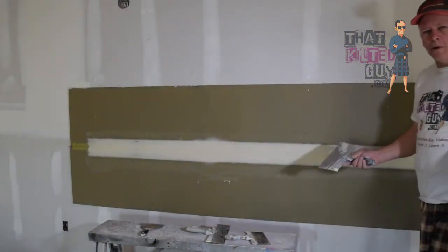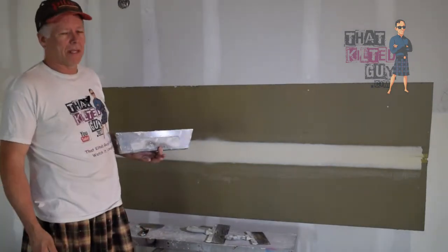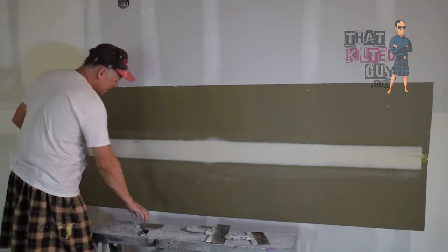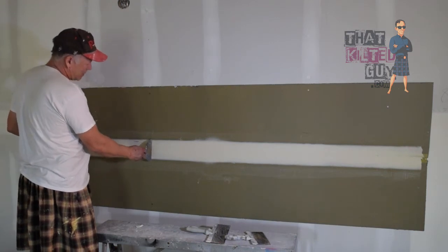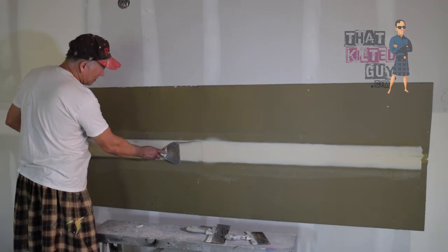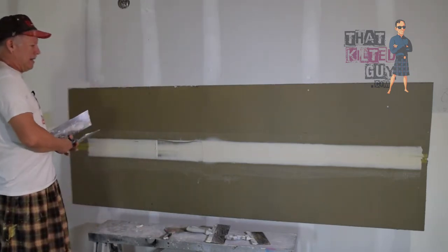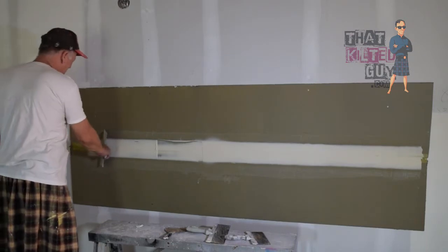Okay, now that's how quickly I do it, but I've done this a million times. So now I'm gonna wipe this off and slow it down a little bit, but you can see where the recess ends up being. It shows you. And if you put my 6 on there, you can see it does span it, but barely. That's why you don't really wanna use this, because if you go a little bit off, you're gonna end up wiping mud out of the recess. That just demonstrates what it should look like, and I think it works well on this darker background.